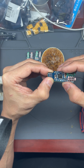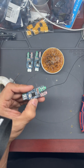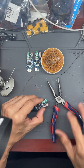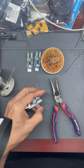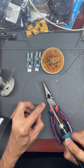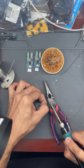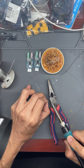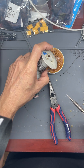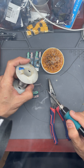Then I'll cut the wire just about here. And again, rather than using a cutter — which I usually mess up — I use my soldering iron to take off the wire covering on this end as well. Then I put a bit of lead on the tip to clean it up.